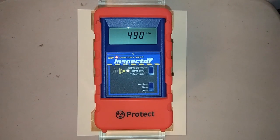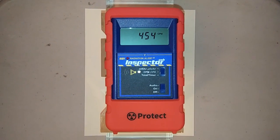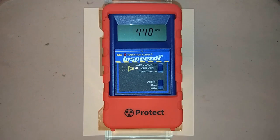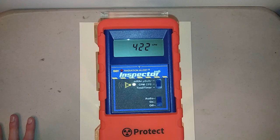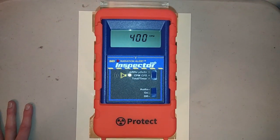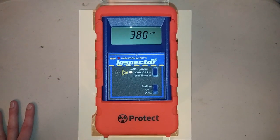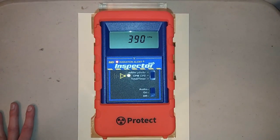The methyl isobutyl ketone, on the other hand, is usually the organic solvent used, although you can use amyl acetate. However, I use the methyl isobutyl ketone. It's a little more stable, and it works a little bit better than amyl acetate. However, it's more flammable. So expect to use some pretty nasty chemicals if you plan on building these. And make sure you use a leak-proof bottle.